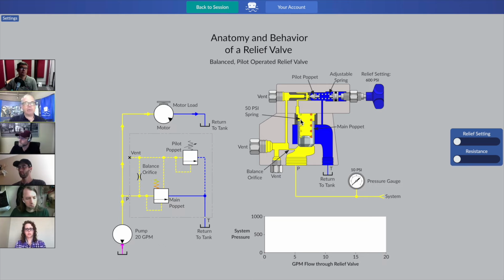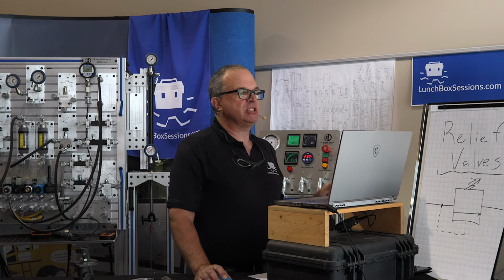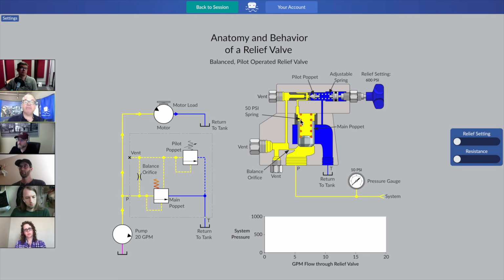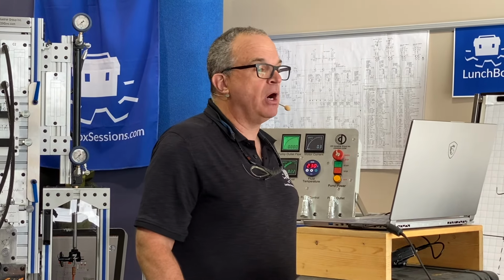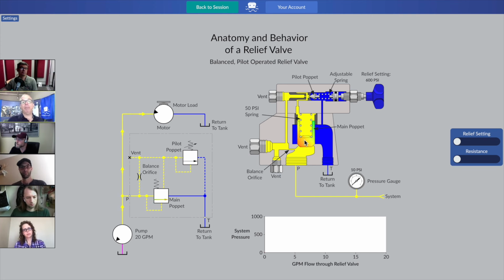Someone was asking earlier, I think it was Robin early in our lesson, she was asking, hey, how stiff is that spring? Well, this particular spring now that we're looking at here is only a 50 psi equivalent spring. If you had that one in your hand, you'd be able to squeeze it quite easily in the palm of your hand. And that's holding our largest poppet closed from the pump path back to tank.